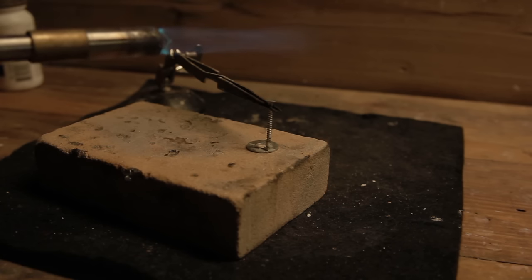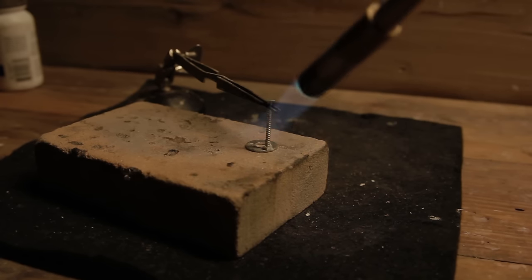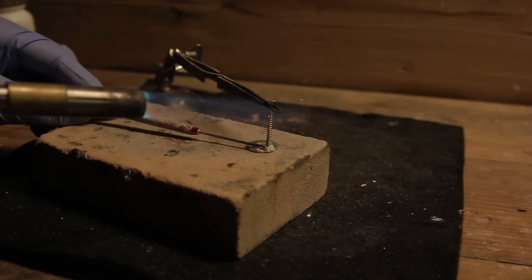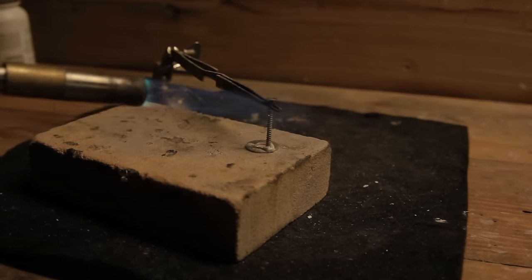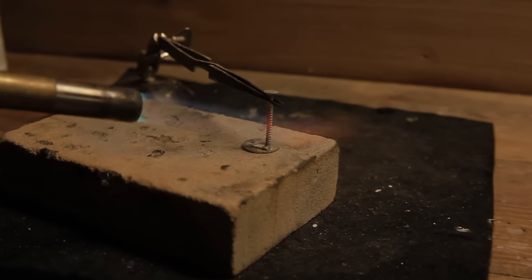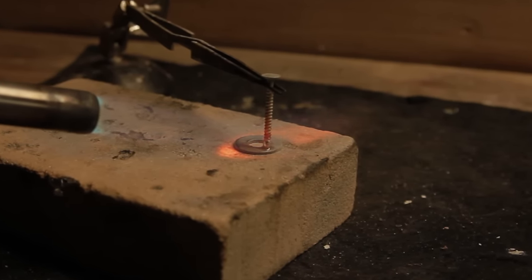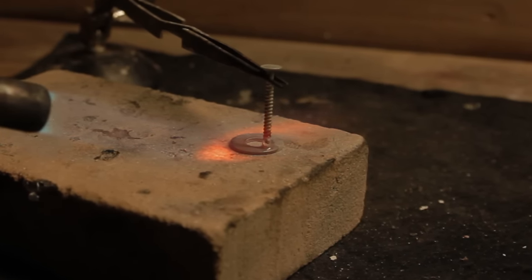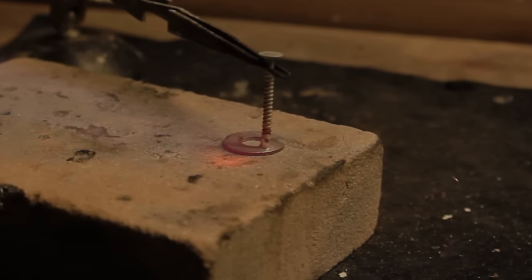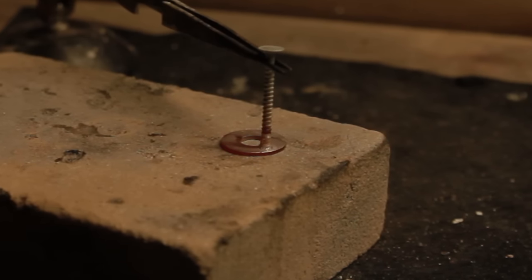In this example, I want to show you what I was talking about earlier — how you need to apply the heat broadly all over both pieces. Here, I heat up the nail a little bit more than I heat up the washer, and you can see what happens: the nail becomes hotter than the washer. You don't want to let either of your pieces get to a bright orange — you want them to get to just maybe a dull red, if that. And what you can see is the silver solder flows up to the nail and not so much to the washer. What you do in that case is back off the nail a little bit and heat the washer more — this will help pull the silver back down to the washer. Remember: the silver pulls wherever the heat is. Or like they say, where the heat go, the silver flow.